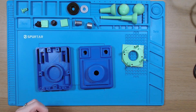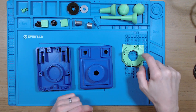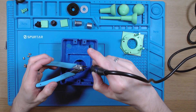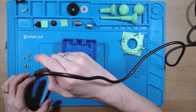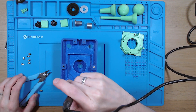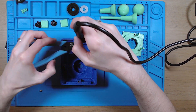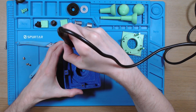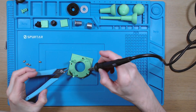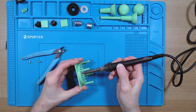So eventually we're going to want to screw all this together. I've decided to use metal thread inserts. These are easily placed into the plastic with a soldering iron. They can be a little bit tricky to put in - you need to make sure they're perfectly aligned and that no plastic ends up inside the thread. It may be worth drilling the hole a little bit wider first depending on the accuracy of your printer. The technique I use is to put one on the tip of the iron, let it heat up a little and carefully push it into the plastic. When it's in position I use some clippers to hold the piece in place while I remove the iron. I strongly recommend practicing on a piece of scrap first as if you make a mistake you may have to print the entire piece again. After finishing this, make sure you give your soldering iron a good clean. After all the inserts are in place I strongly recommend testing them and making sure you can screw the screw in all the way without any problems.